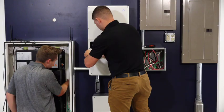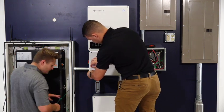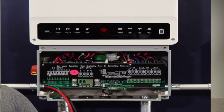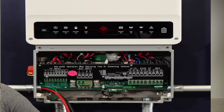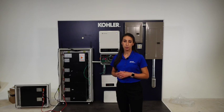First we will open the inverter and take a look at the connections. Using a five millimeter Allen wrench to remove the cover of the inverter, our hybrid inverter has multiple connections: an auto transformer connection, four MPPTs for PV, a backup connection for the protected loads panel, AC connection for the grid, a connection for the measuring CTs, and the connections for the battery management system of the batteries. The inverter and auto transformer conduit fittings are a one inch diameter. Appropriate adapters should be applied when conduit fittings with different dimensions are used. Insert the corresponding fittings and then fasten the joints.